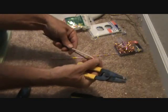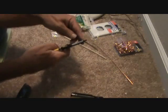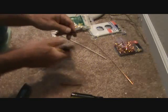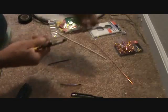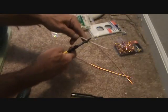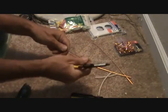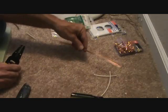Here's my ground wire I'm going to use. I've got a black and white — I could leave those for pigtails for other plugs — but I know I've got a couple more plugs to do, so I'm going to strip this off right now. I don't want to strip all of it off in one go because it's kind of hard; just do little sections. I've got three of them to do, so here are my ground wires. I didn't have to buy extra ones at the store — just use a little piece of Romex.